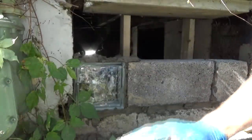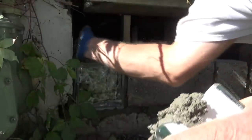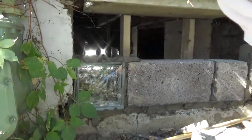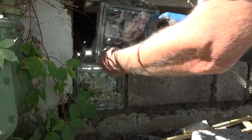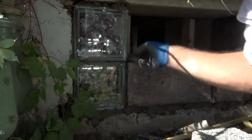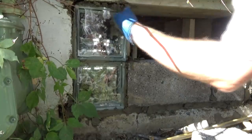We're going to fill these holes in. Now we're going to put my second glass block in. Don't forget, this is a fast drying cement. Putting that on like that, making sure that's right. We're going to put one on the top too. See how we've got it on the side and the top, so it goes right in there, just like that. Now pack this up pretty good up here, and then we go back. Just like that.